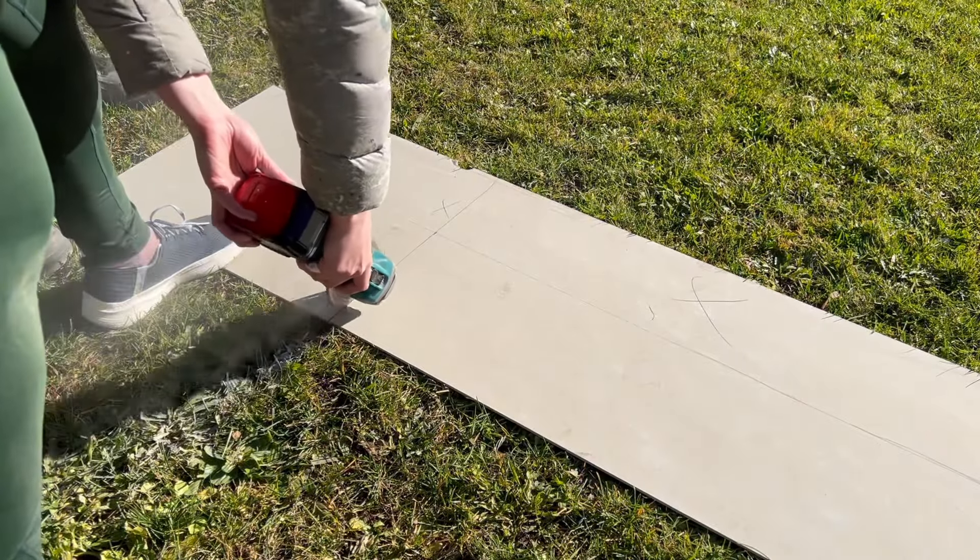You need to make sure that your sponge is not too wet and that you don't rub out too much grout, because you don't want the grout to be too thin where you've removed too much from each of those lines. I worked in sections around the bathroom because I didn't want a section to go hard too quickly where I wasn't able to wash the grout off in time. It will depend on where you live and what the temperature is as to how quickly the grout is going to dry and what size sections you need to work in. If it's going to be really warm, you need to work in smaller sections and wipe the excess off quicker so the grout doesn't go hard. For me here it's winter and fairly cool, so I was able to work around the room in about three sections.